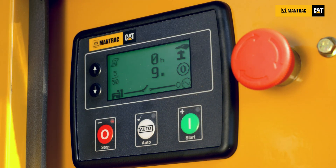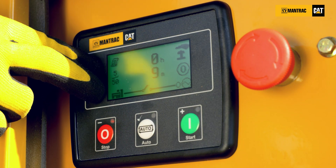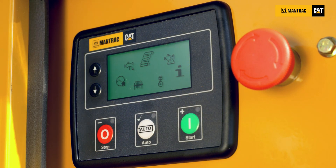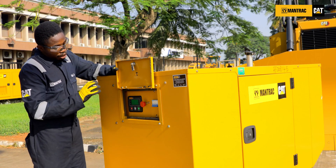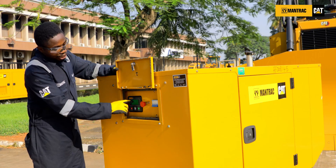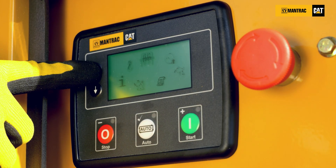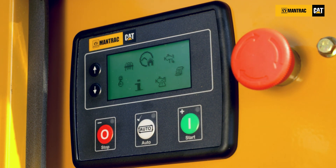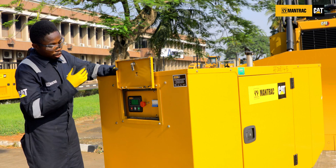After checking your events, how do you go back to the main menu? Press this up and down button simultaneously and you'll have the icon displaying again. Then navigate to the icon that looks like a home symbol at the center of the panel by pressing this button. When the home icon is enlarged at the center, press the auto button to take your panel back to home.